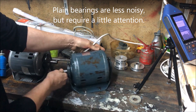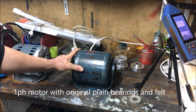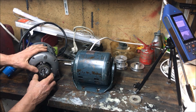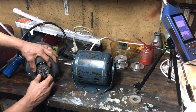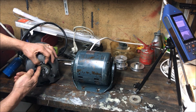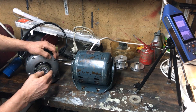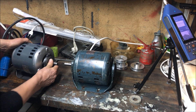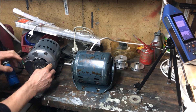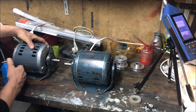First I'll put on this single-phase motor and then you can hear. Of course this resilient mounting — this crib here — makes it less noisy than others. The way it's done is with a rubber washer here, and this also needs replacement. On the other side I've used some other replacement material, so I'm going to cut off what was damaged.